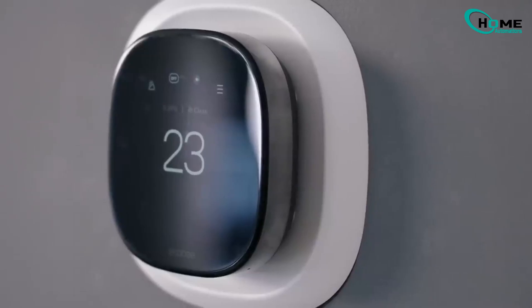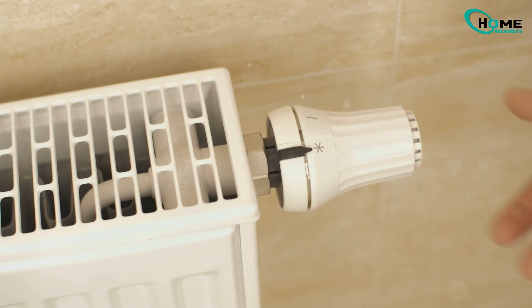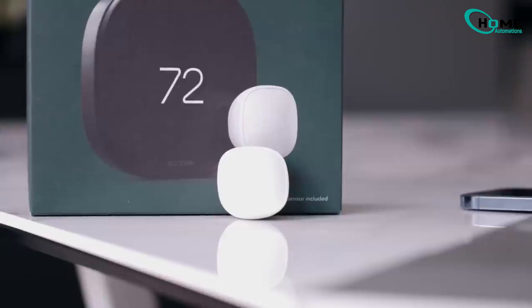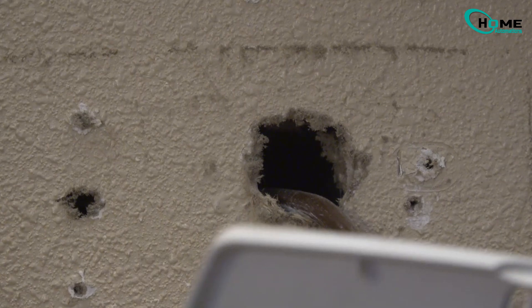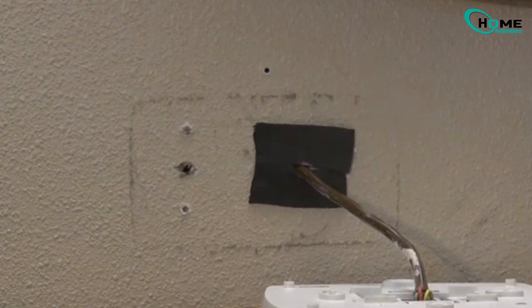Why Continuous Calibration Happens. Wi-Fi Signal: weak signals can cause the thermostat to keep recalibrating. Check your sensor's location and ensure the Wi-Fi signal is strong. If the issue is still there, check for excess air. If there's an open hole behind the thermostat, air might be affecting the sensors. You can plug it with plumber's putty to insulate it better.